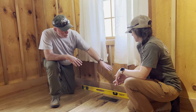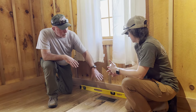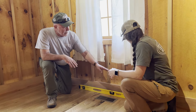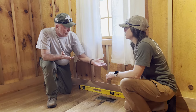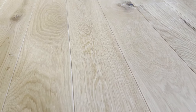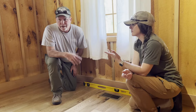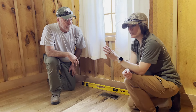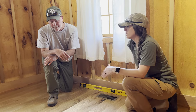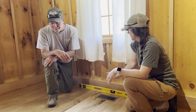That way, when it came down, it contoured to the hardwood floor that we had just laid. We still had exposure on the ends, but it wasn't anything that the three-quarter inch shoe mold couldn't cover up. So it was a little bit of work, but it's the right way to do it. And it works in reverse on our sidewalls — we had just the opposite. It was a challenge, but when you're in the field in a location like this, you really have to cut your losses. We did the best with what we had, and that shoe molding we made out of some of the poplar was the perfect way to clean it up right at the end.